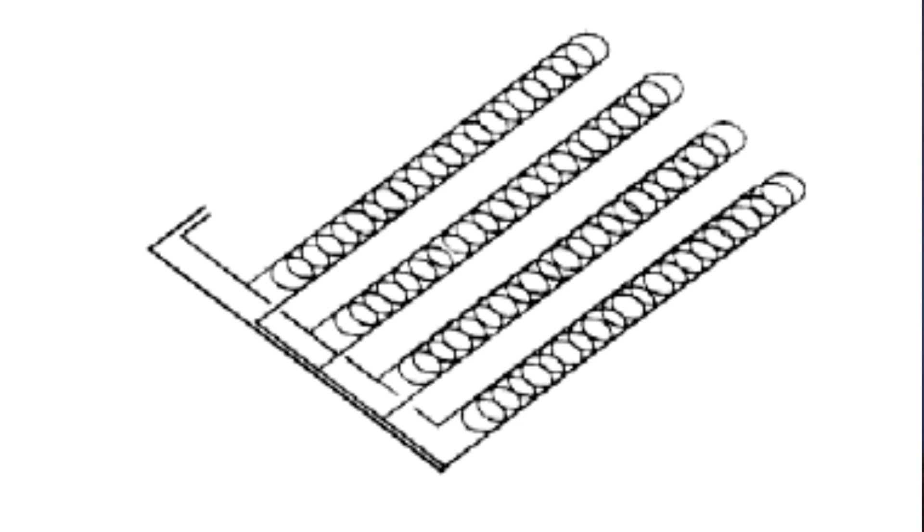In order to size the loops you're going to need, there are so many feet of pipe per ton of unit size that you have. So if you have a three-ton system, you're going to have probably three different loops going back and forth out in your yard, and those loops are going to be a specific length. In my case they were 600 feet long. Some places could be 500, some 800, some 1,000 feet. It's dependent upon your soils, so know those soils.